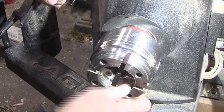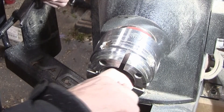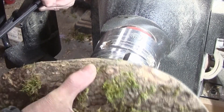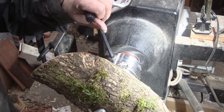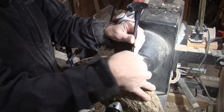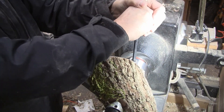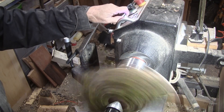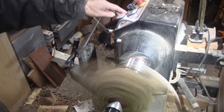I've got a different chuck in with these heavy duty jaws. There's a dovetail right here on the internal portion, and not many jaws have an internal dovetail. It also has little gripping rings on it. I push that up against the face of the jaws and tighten it up. We'll start out slow and see how it spins — it's pretty true. 1300 RPMs, not bad at all.